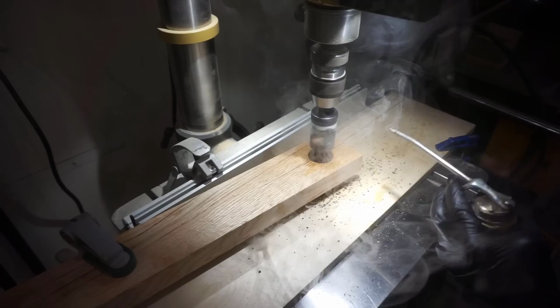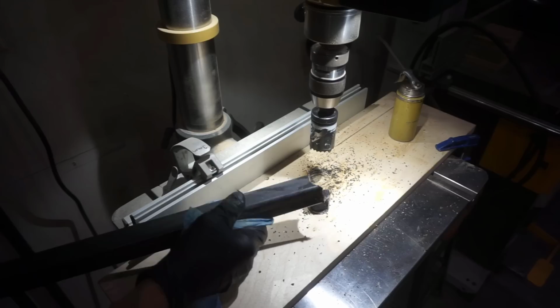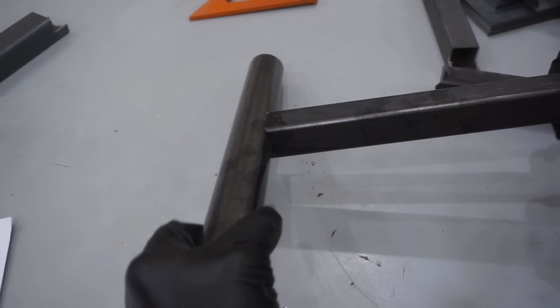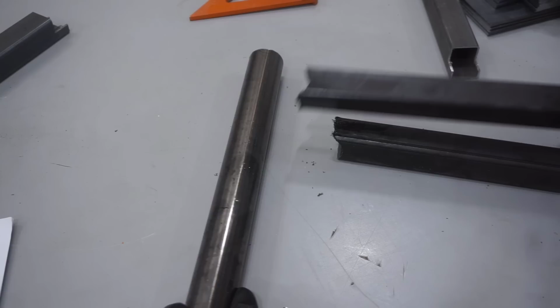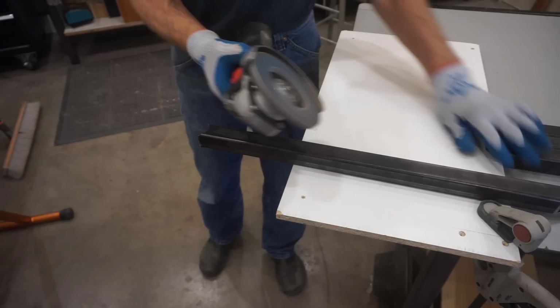Because this isn't a machine shop, and I'm using a block of wood as a drill guide for a hole saw through a piece of steel, there's some variation in the way these curved notches come out. But by and large, it's a quick, safe, and reasonably accurate way of getting consistent results for the round notches on the ends of the four leg tubes. And these results are more than acceptable compared to other methods for making this sort of a notch with other tools or different techniques.